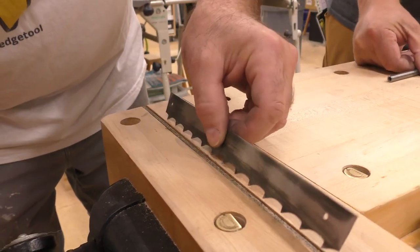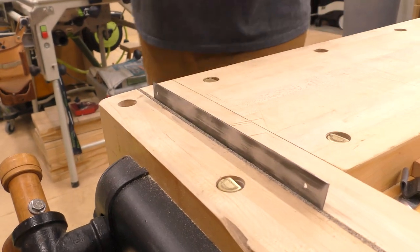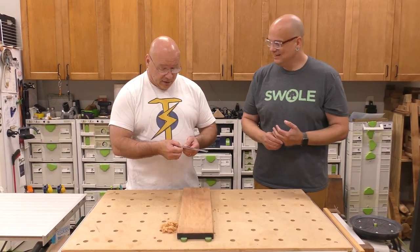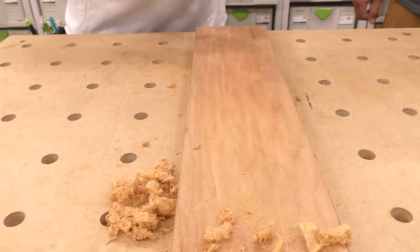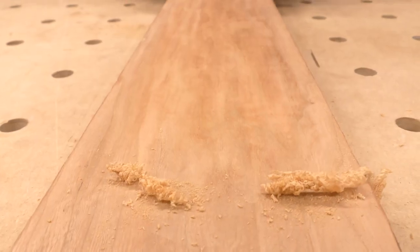I can feel that burr — it's very slight. I'm going to turn around and have you do it, Big D. You're a pro at this already. Had a good teacher. You did it — now you have a new cabinet scraper. Let's put it to the test. I'll make a couple of swipes and I'll have you make a couple of swipes. Look at that — perfect tool to clean up some glue line. That's cutting really good. Basically, a free cabinet scraper. As we always say, be positive and stay sharp.